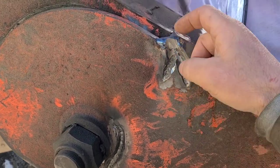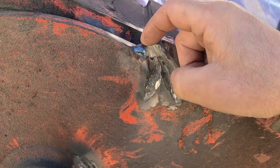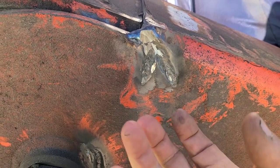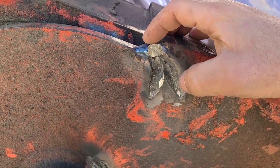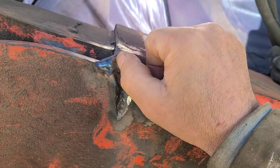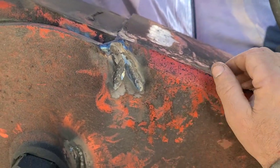When you think about how your uphill welding is going to go, you realize how important it is to do this first on an edge like this. If I didn't build this up and I started at the bottom welding uphill, by the time I got to this upper edge the material would be so hot I'd have a hard time getting it sealed and filled. Now that I've got considerable material here and I've taken the grinder to build me a ramp to come up into, I can start down here and weld right up into it — I've got some meat, some material that'll hold that heat and hold the weld I'm about to make.